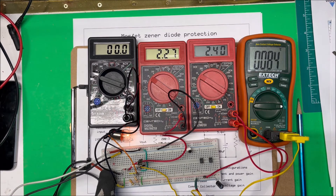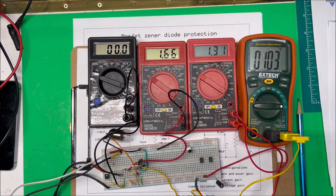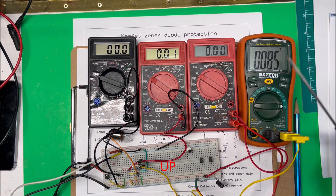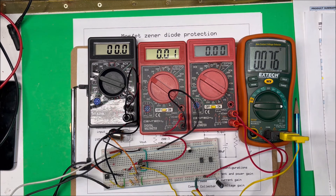This is the region we don't want to run in — I'm already at 80 degrees centigrade and at 2.4 volts I'm going to burn this thing up. I hit 100 degrees centigrade already, so I'm going to let that go. The threshold voltage is very important: even at 2.4 volts the resistance goes way up and the temperature shoots up to 80°C or beyond. The circuit works fine from 12 volts down to about 3 volts, but stay above 2.4 volts and turn it off below 1 volt, otherwise the unit will get too hot and burn up. That's the Zener protection for a logic level MOSFET.